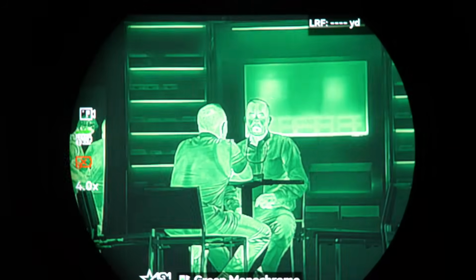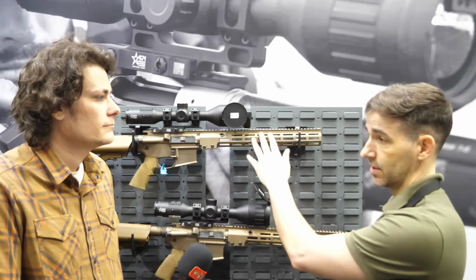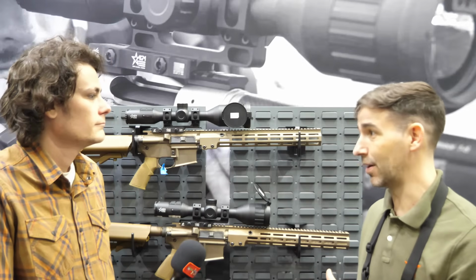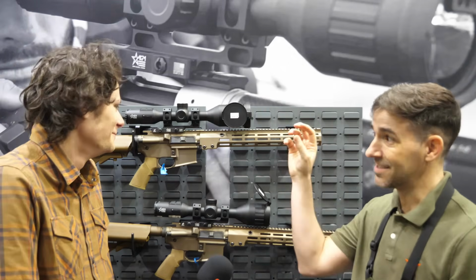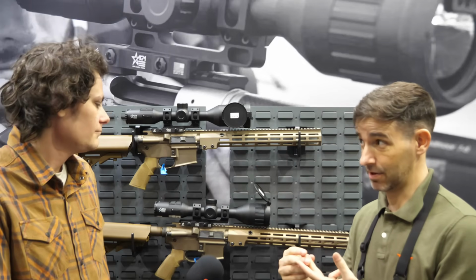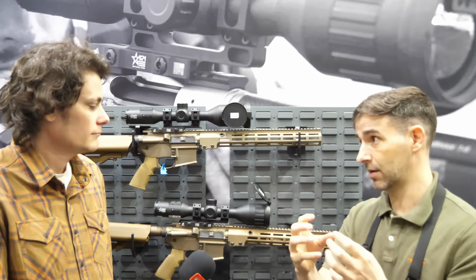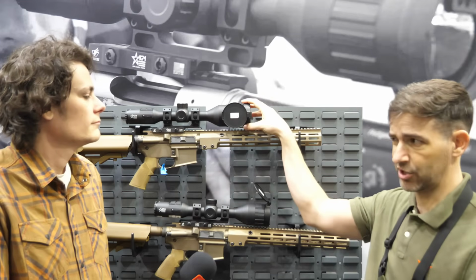And is there a different base magnification between the different resolutions? Yeah. As we tell people, if they say, I really like this, but I wish you had a 3.5x version or a 2x low base mag version, we say, well, you can't cheat the physics. That is determined by a mathematical equation: lens size, sensor resolution, micron size of that resolution, and the display in the eyepiece. As you change those factors around, it alters the base mag, and that's your true optical. So I can manipulate it by asking, should I do a 70 millimeter lens? A 65? A 60? That may change it from 2.75 to 2 to 2.5, and then we just adjust to what we think the market wants best.